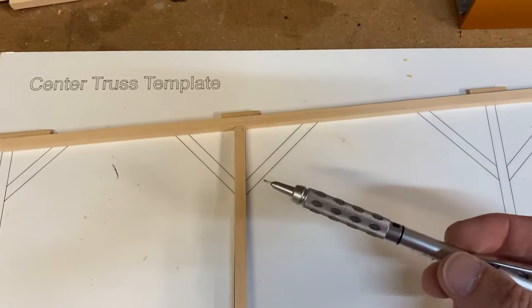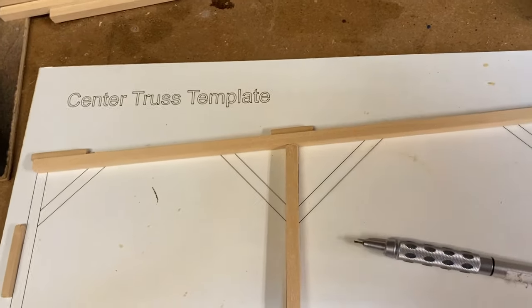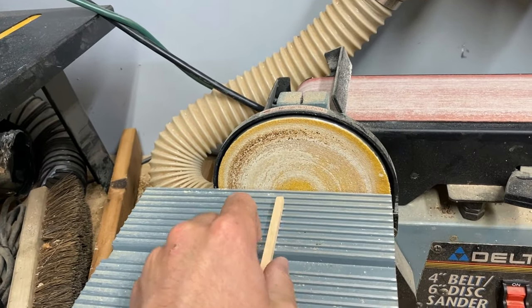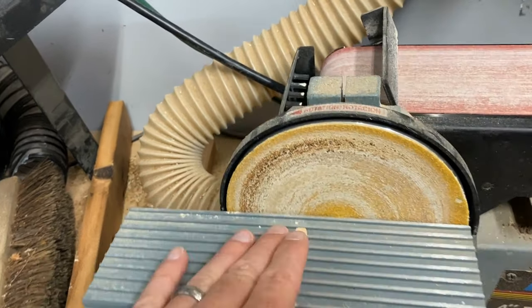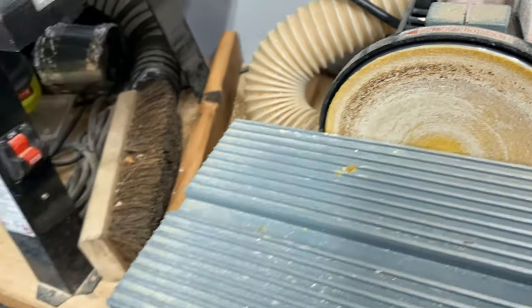So what we're going to do is, I've got a really fine pencil that I use here when I'm doing things in the shop. I'm going to mark out what I need to sand down. And then we're going to come over here. The shop is an absolute mess right now. And I've got this old Delta disc sander. I have ordered 320 grit paper. I've got a little bit of grip left on this old one, so it's going to work for today. Then we can just hold that angle and sand that down,